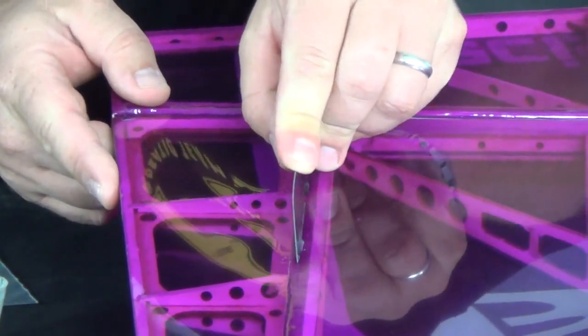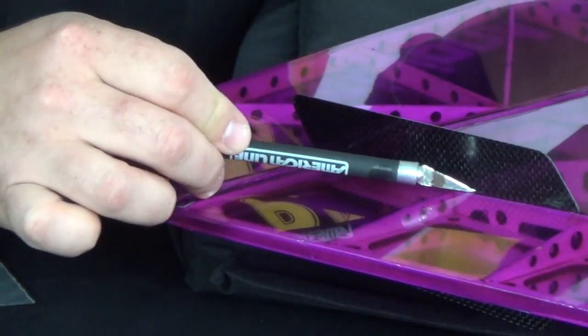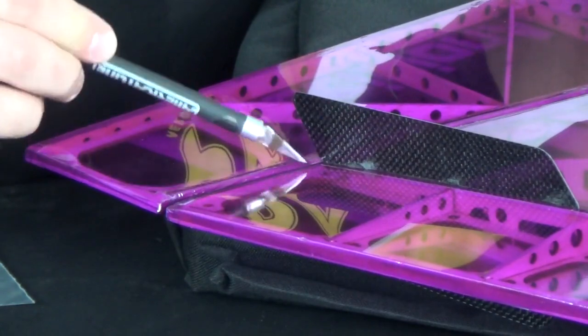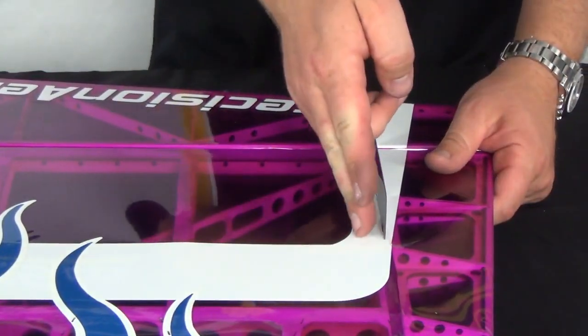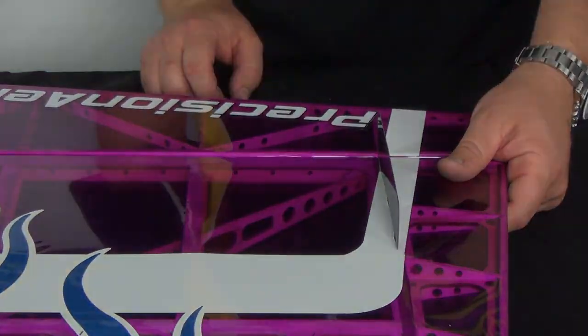After you've seated and aligned each one, if you can leave a very small strengthening fillet of epoxy around the base of the VGs, then that's all the better. Before you set them aside to dry, make absolutely sure that every VG is perpendicular to the wing surface. Use tape to hold any stubborn ones in place as the epoxy cures.